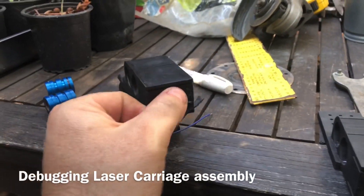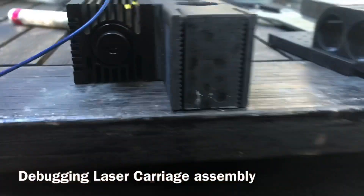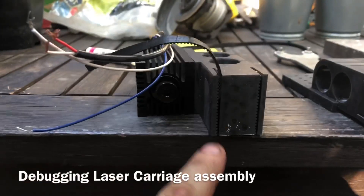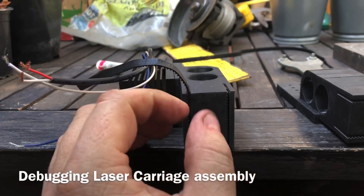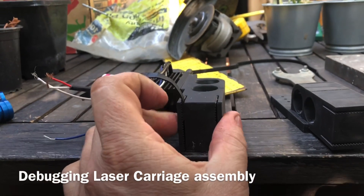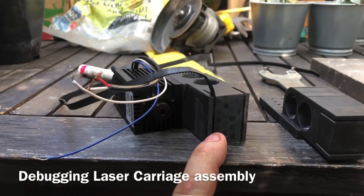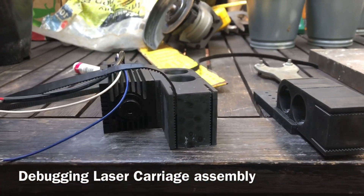As you can see, it sits flat on the build plate, and then at this end here, the GT2 belt guide — essentially that's just designed to capture the belts and have enough engagement so that, hopefully, it all works. I might have to put a bolt through to keep it clamped up if it stretches over time, but there's a gap there — I could just put a straight hole through and then clamp it down once it's all in place. That means the tension will happen off the steppers, and this is just an attachment point. Because one side comes in through the top and one side through the bottom, it's really easy to get it all set up before cutting your belts, so you don't run the risk of getting your belt too short.